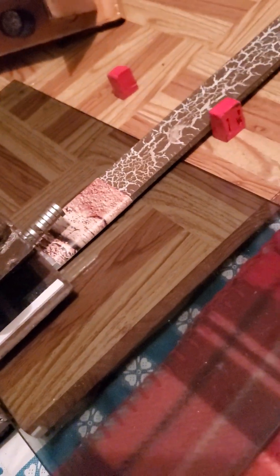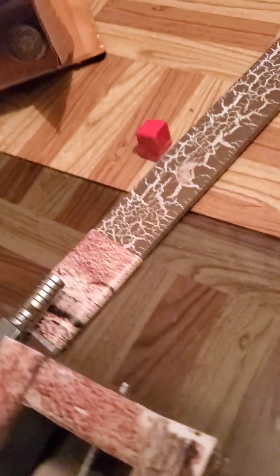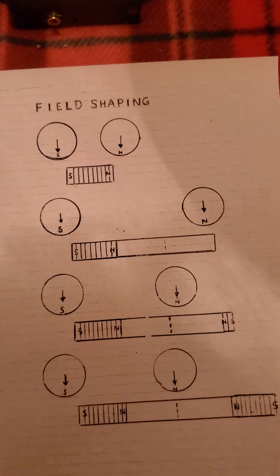I'll give you some measurements. For the flapper magnet, when it's down in its down position, it's about three-quarter inch between there and there. You can get it down to half if you want, but there's a little bit more input for your disengage and engage. This design has a pack of magnets with a bar in the middle — I'll show you the diagram in a bit. This is a new design, very, very powerful. It works on a field shaping — the magnetic field shaping component that I've been working on.